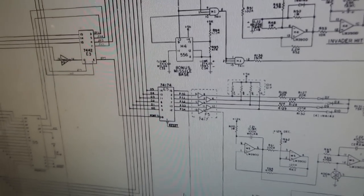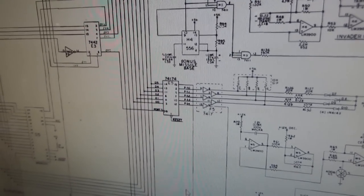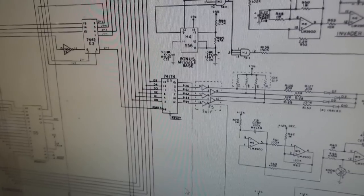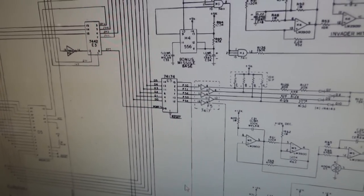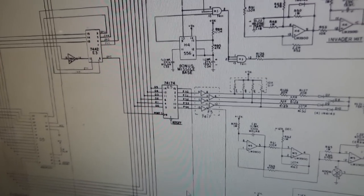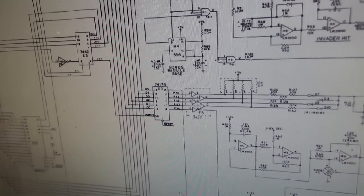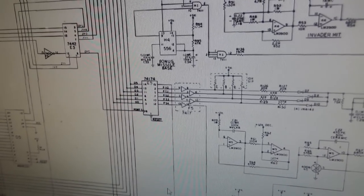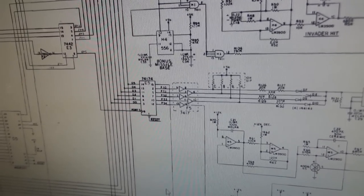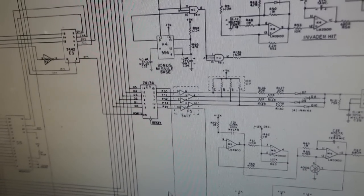So this is the Midway PCB. It's an L-shaped PCB. It's commonly called the 8080 PCB, the Midway 8080 PCB, because it uses an 8080 MPU. It was on things like Gunfight and Tornado Baseball, and Seawolf uses it, and Space Invaders, and a couple other games. The smaller of the two boards that connect together, and we'll see them here in a minute, is the board that does the sound.